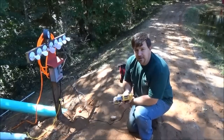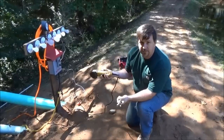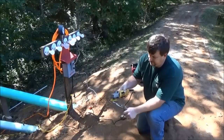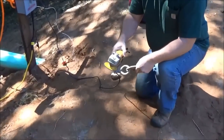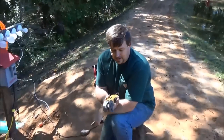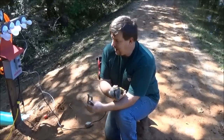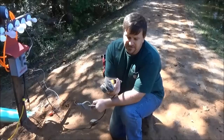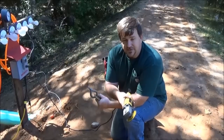There are pond shops and then there are pond shops — sorry, couldn't resist. I've got my dual grinder and wanted to show you: this is running off the hydro turbine and inverter generator, so it has no problem with the startup momentum. I was only pulling about 300 watts according to the kilowatt meter. You can do a lot of work in a short period of time off your hydro system — you could run 20 Dremel tools off this thing. This was about a seven-and-a-half amp startup, absolutely no problem running any power tool off the pond. Engineer 775 signing out.